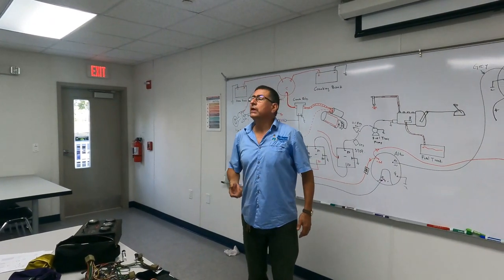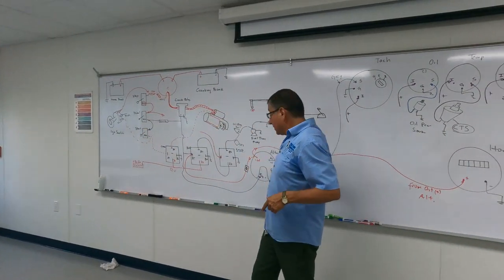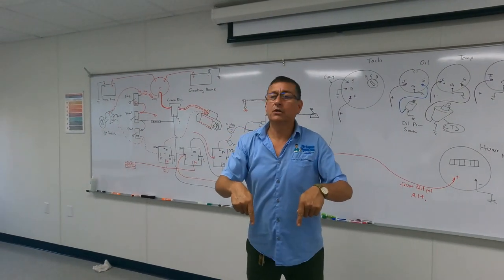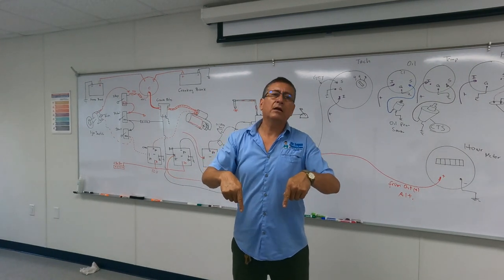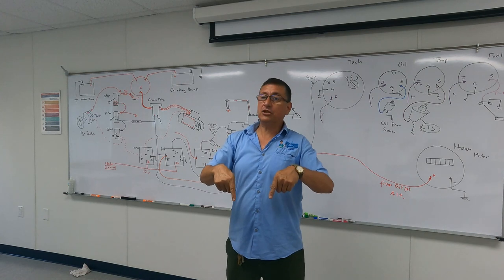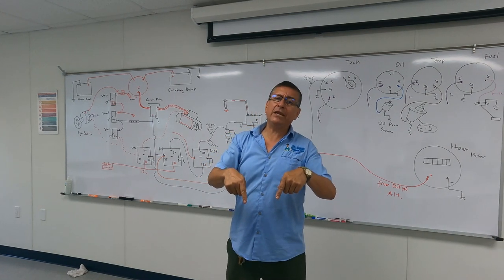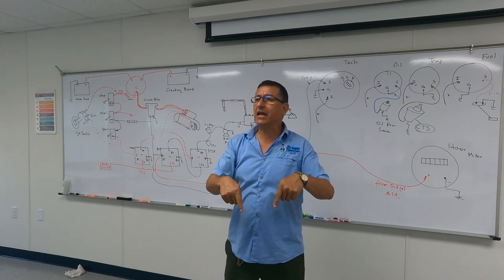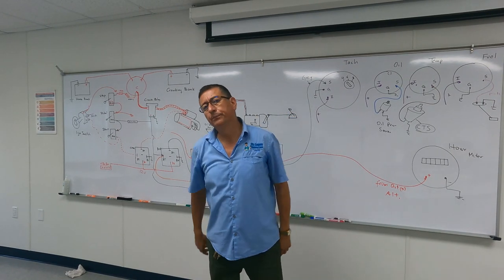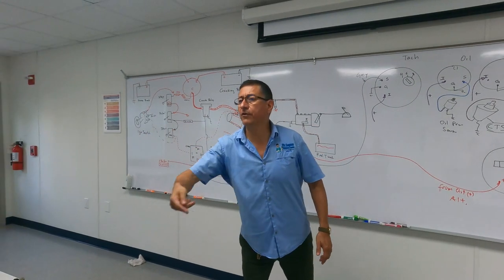Go to the battery. Excuse me? Go to the battery. I go to the battery and I check the voltage. 12 point something. I say to my friend, hey, my friend, start the engine. The engine starts and the voltage goes down: 11.8, 11.7. Is the alternator working? Nope. This is the problem. I don't have current coming from the alternator.